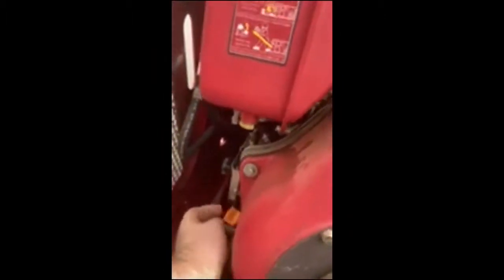So I put 2 litres in it, and then just a little bit to the top up. You can see there, that was the full container, and it's down to just there. It was a 15W-40, suitable for diesels. But I would think it's a good idea to change it first at 5 hours, then come back and do it at another 10, and I probably would do it maybe about the 20 mark after that, but keep an eye on it. Like with any diesel, it'll go dirty. See, it's very dirty there.